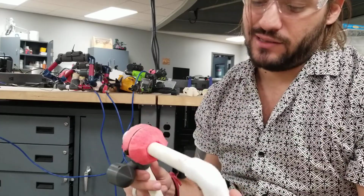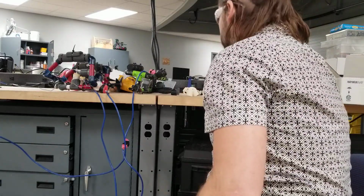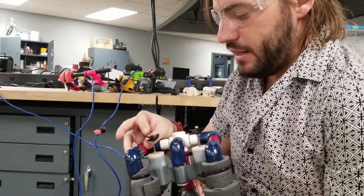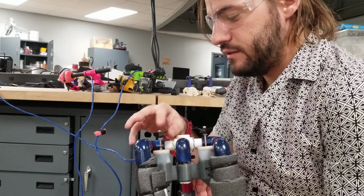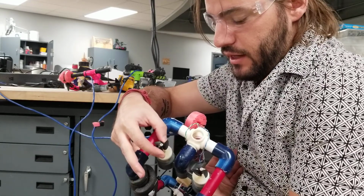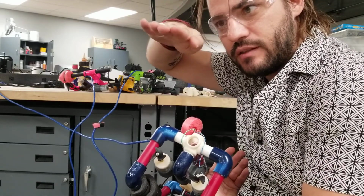And the trick is to find that balancing act of where to balance and how much you have to have. Another thing that you can do to modify, as you'll see in this one, is they've got different props in the back. They went with these props right here. These props are 3 blades, and they're not as large of a diameter, so they're not as wide as the stock ones. They're smaller, and they have more pitch, which means more of an angle. This is a lot of pitch. This is not much pitch.